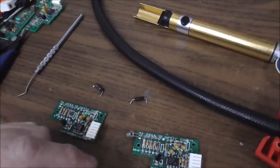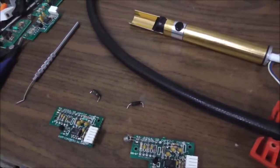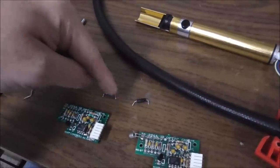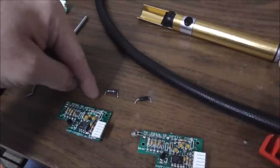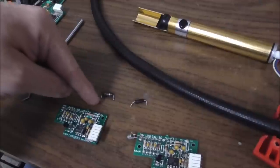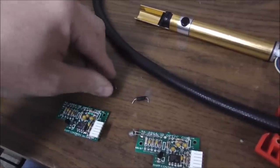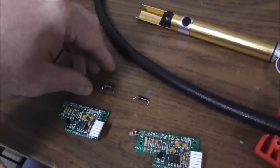Another thing I was going to mention about testing stuff in circuit: if you think about the way things fail, you can often test things in circuit. A resistor, whenever it fails, usually doesn't short, it opens up. Because of that, if you test a resistor in circuit, it's resisting current from here to here. So if you test it in circuit, it should never be higher than whatever the resistor is. So this is supposed to be 47, and this one's 500K or 5 meg or whatever it's measuring.